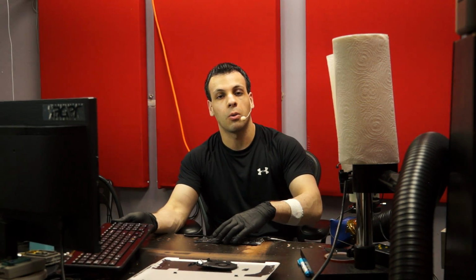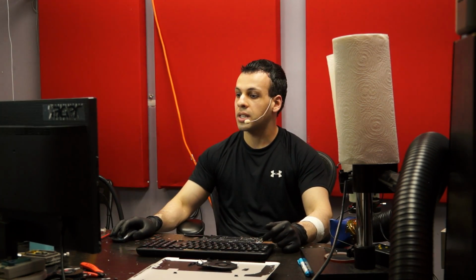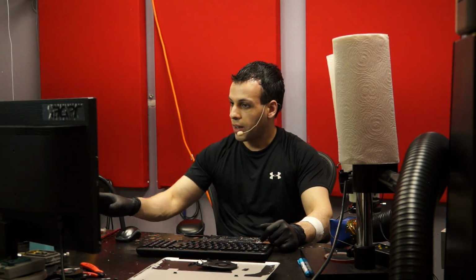The first thing that I have to check, if you've watched my videos on what power rail comes first, the importance of sequence, and my one-wire circuit videos, is that PP3V42_G3 hot has to come first. So let's take a look and try to see if we have that on this board.